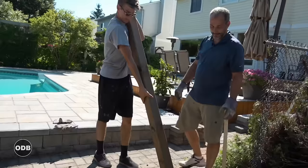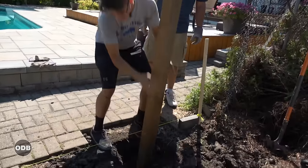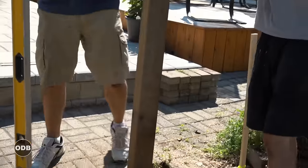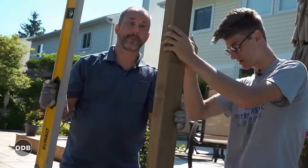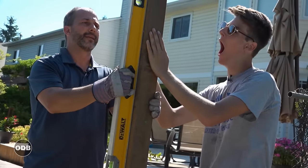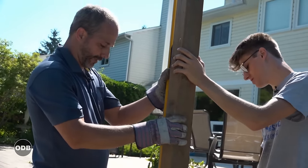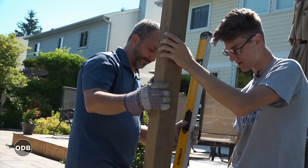I want you to pick up that post and get on the other side of the hole. When I'm using a level, I like to use it as long as humanly possible — I've got a six or seven foot level for a six or seven foot fence coming out of this hole. We're gonna stick the bottom of the post up against the string and find out if, when we're just touching the string, we're level, or if we need to readjust. We're not level, so I've got to lift the bottom of that post and push it a bit.